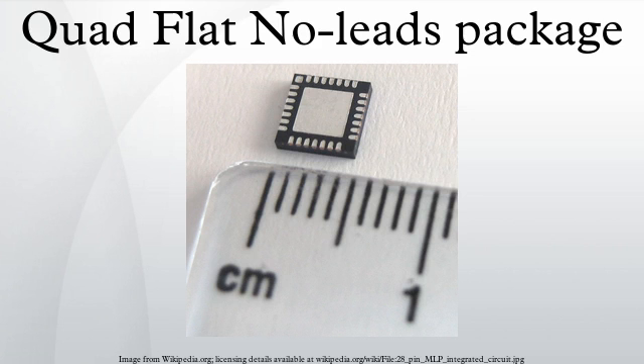The cross section of a Flat No Lead package shows a lead frame and wire bonding. There are two types of body designs: Punch Singulation and Saw Singulation. Saw Singulation cuts a large set of packages in parts, while in Punch Singulation, a single package is molded into shape. The cross section shows a Saw Singulated body with an attached thermal pad. The lead frame is made of copper alloy and a thermally conductive adhesive is used for attaching the silicon die to the thermal pad.